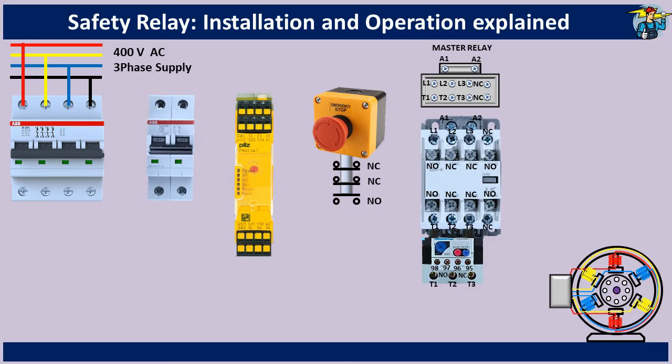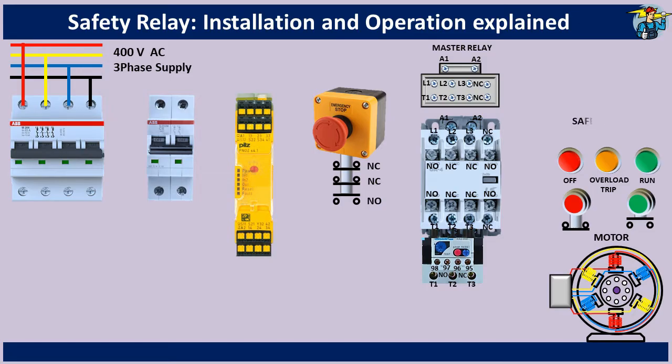Safety relays need two or more relay contactors on their output side to monitor the feedback loop. Motor start/stop push button switches and indicator lights are provided here. For the safety relay, you need a reset push button switch. Although optional, I have included an indicator light here to show that the safety relay outputs are in the off position. If the motor stops with this blue lamp on, you must check the safety relay to see the actual fault from its LED indicator lights.